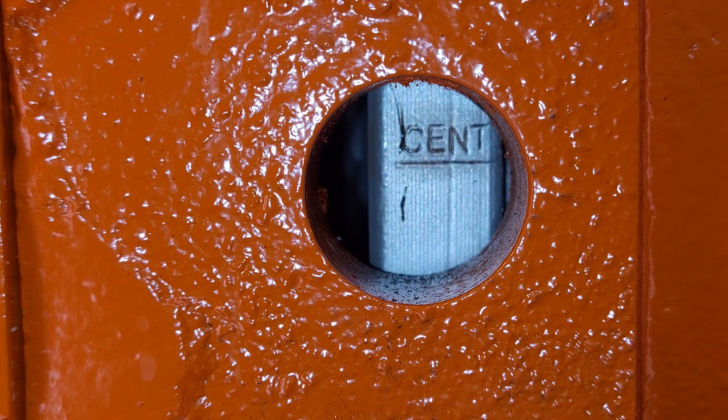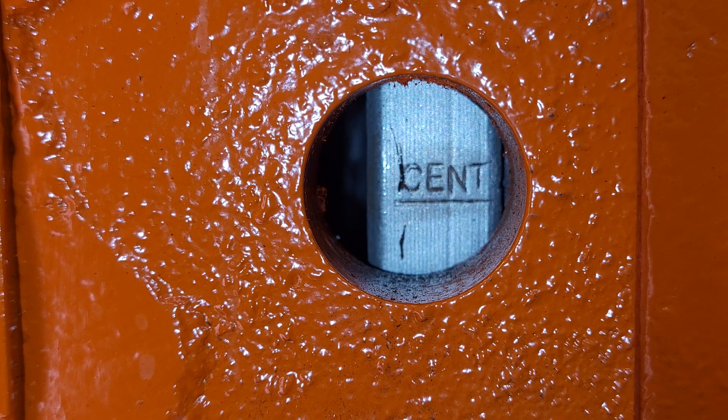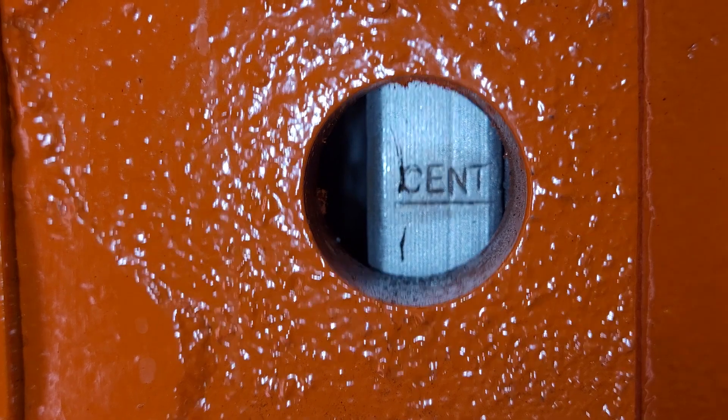I should be pretty close at this point, so I'm going to go real slow. The first mark I should see is the fire mark — and I'll pass that. Apparently I already passed the fire mark while I was turning it over for the compression stroke, so that should be top dead center, cylinder number one on the compression stroke. You can verify this by looking into the cylinder with a flashlight to see the top of the piston, or feeling with a screwdriver. We turned it over till we felt compression, then moved it to top dead center. This is where the magneto fires when starting by hand. Once it gets to higher RPM, it will advance 30 degrees and start firing on the fire mark.